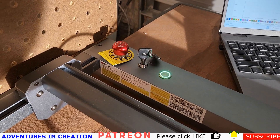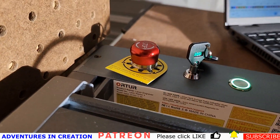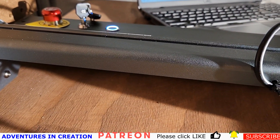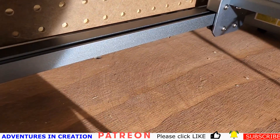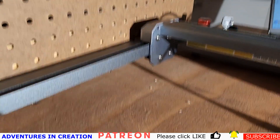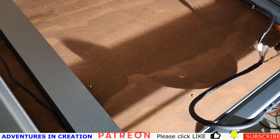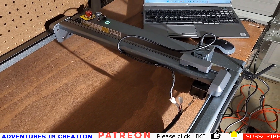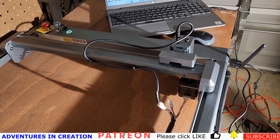Here's the laser running, and here's the command and control panel. When the light's on everything's good. It has an emergency stop button, but I think it's kind of small and because of the way the key is positioned, if I had to hit it in a hurry I'd probably hit the key instead. I would have moved the key somewhere else to give more space for the emergency stop. The machine itself is actually pretty well built — quite quiet, moves fast and fairly accurately. This one has a massive 400 by 400 mm bed, which is a good size for engraving. Setting up origins is not too bad — you can move it around by hand and in LightBurn set the origin wherever you want.